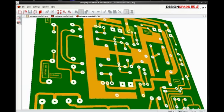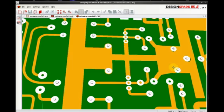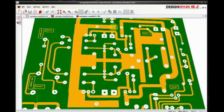And the H-bridges on the back, as you can see, I've used really heavy gauge track. Well, when it's etched it will be. I've basically done it symmetrical so that it's balanced, so that any noise we get is basically cancelled out. It's like an E-shaped ground plane section, E-shaped and mirrored, so it should enclose any EMF or magnetic fields within this area, so it shouldn't escape and interfere with the oscillator.